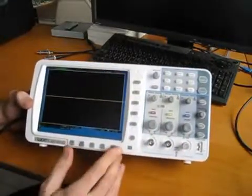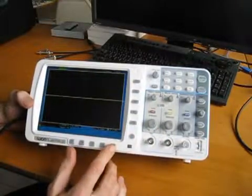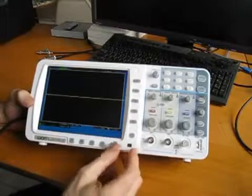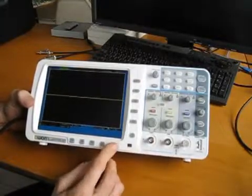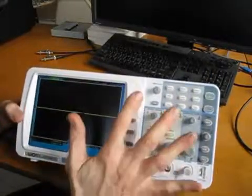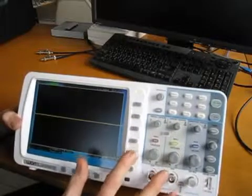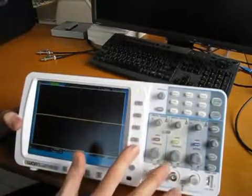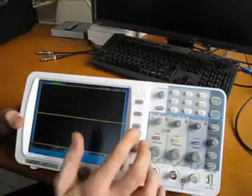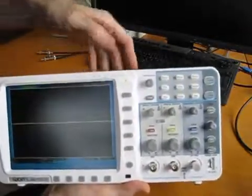These knobs, the menu select knobs, sorry, buttons I should say, you can tell from the sound of them. I mean, there are these little cheapo membrane switches that anyone who's made any PCBs is well aware of. Generally, it's okay, but you'll notice, first of all, these are all mounted on a separate PCB, which is slightly floating there. So I hope that camera picks that up. If I wobble this a little bit, you see them all wobbling. So that's a little kind of shoddy looking. But more so than that, they've got it mounted so close to the display in such a way that when you're clicking them sometimes you're causing a little bit of a disruption to the LCD display.